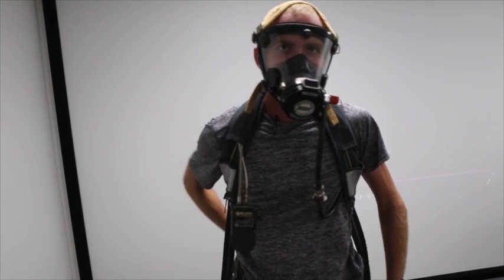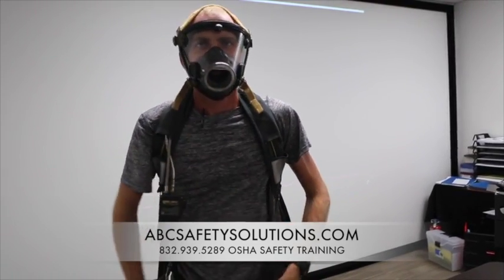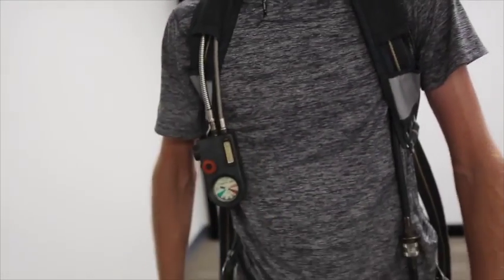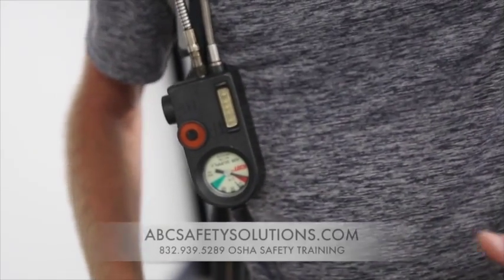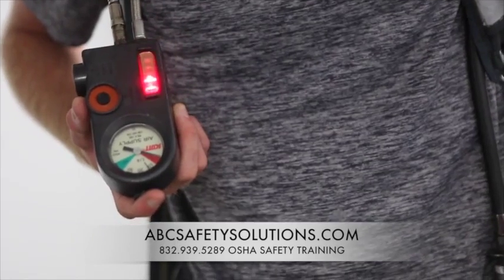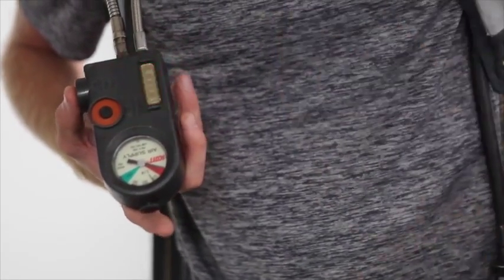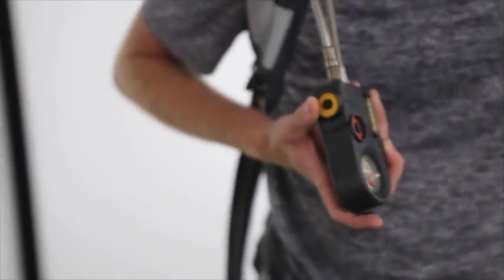Then you're going to turn your tank on — properly, before you do your SCBA, make it look better than that. This is going to be your air supply. That's what it sounds like if you're down, you can't move, and you're sitting still for a bit — those are the two main alerts. If I'm standing still for a while, it's going to start doing that little siren thing, getting louder and louder, so you can move or personally turn it off yourself. Push it twice to reset it, and that's reset.